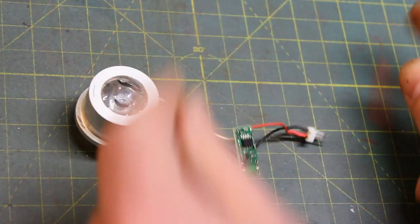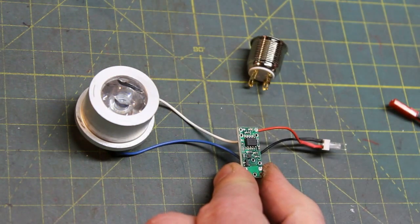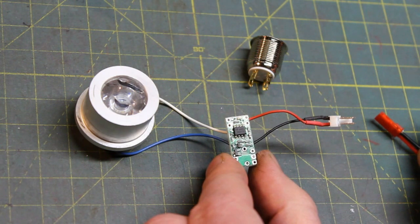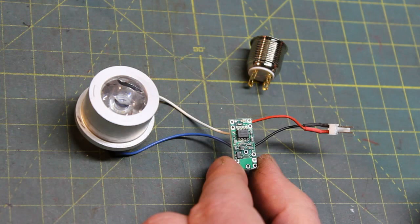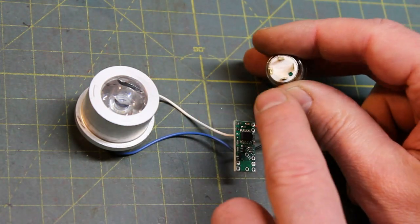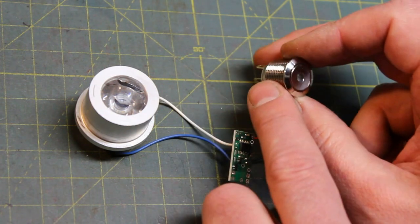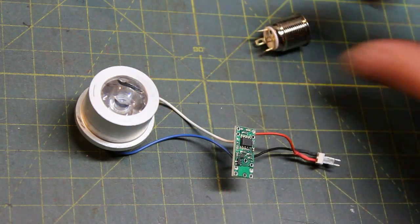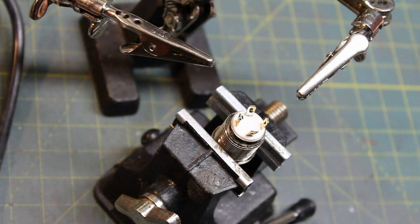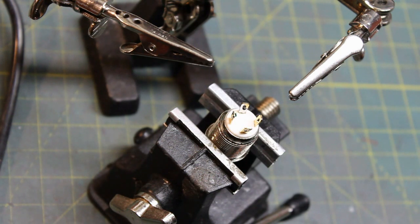Any momentary switch attached to those switch wires is going to work. It might be wise to attach your switch wires to your switch first and then attach the battery — either way works, but attaching the battery last is always best practice. I'm going to wire up some wires from the switch legs. This switch also has two other legs for the LED inside the switch, which I'll show you later, but first let's wire up the switch.